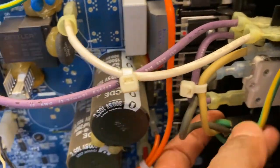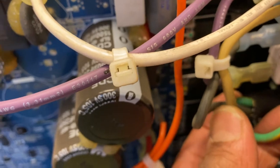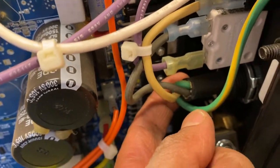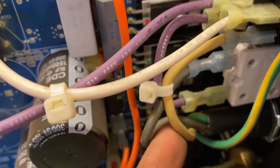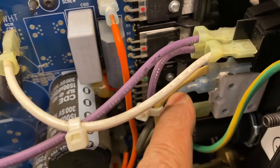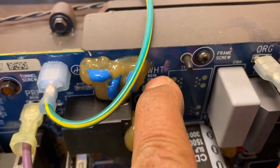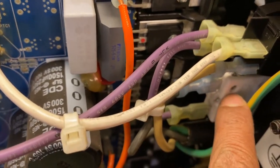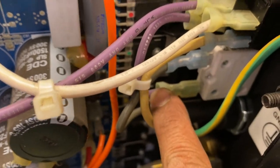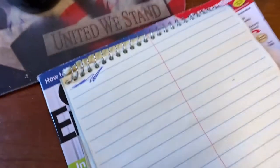From the main cord we have three wires: the ground which is green, the white — which looks a bit yellow from heat — acting as neutral, and the hot wire. The yellow-white neutral goes directly from the cable to the switch and then to the board. The hot gray wire goes to the breaker, comes out and goes to the bottom of the switch, then from the switch into the board.